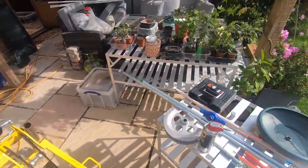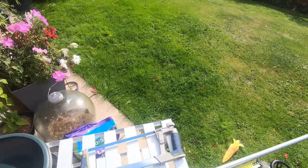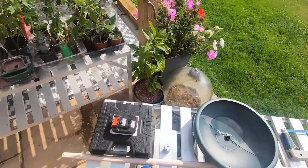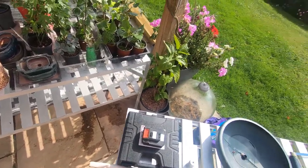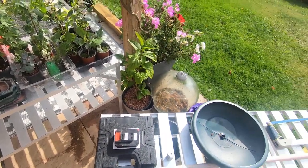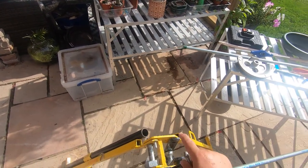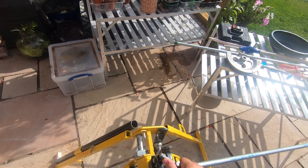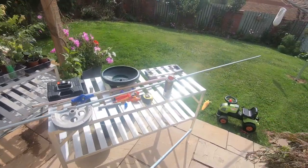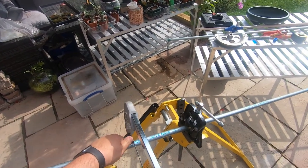So we're back out here with the pipe vise and the pipe, and we're going to go with 61 inches to the end of that coupler. So 61 is going to take us to that number 4. That's nice and easy, don't need to mark it up, I can see where it's going to be. So we'll get this into the vise, go about there, clamp that up nice and tight, pick up the hacksaw and we'll cut across the 4.